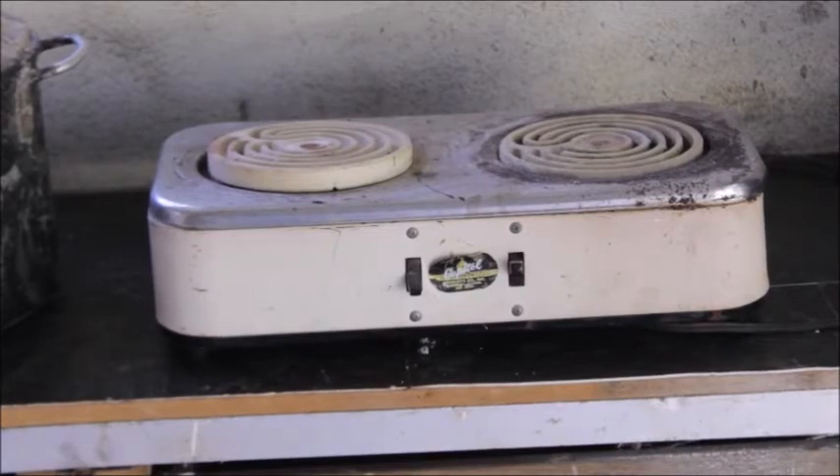It's dead simple - you can get a clay flower pot. I'm going to show you something better than the clay flower pot, but the clay flower pot will work. You can wrap some aluminum foil around the outside of the clay pot and that will help retain the heat. Now this thing gets crazy hot, and you only need to burn your molds out in this thing for five hours. You take your mold, as soon as the investment is dry, you put it in your household oven at 220 degrees and leave it in there for two hours. Then you bring it out here, your hot plate is already heating up, you put your mold on there, put it under that pot, leave it for five hours, and you'll have an absolute perfect burnout.